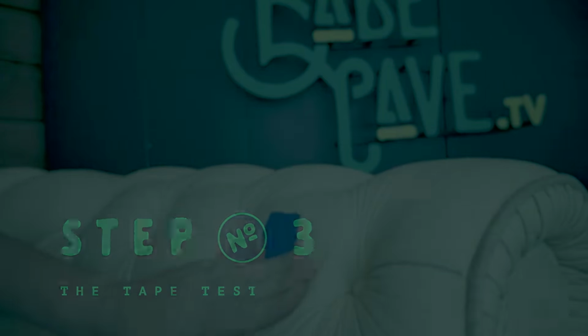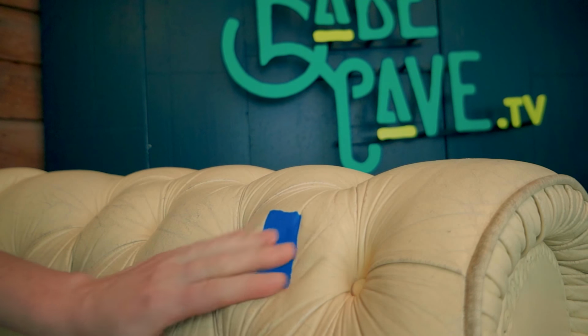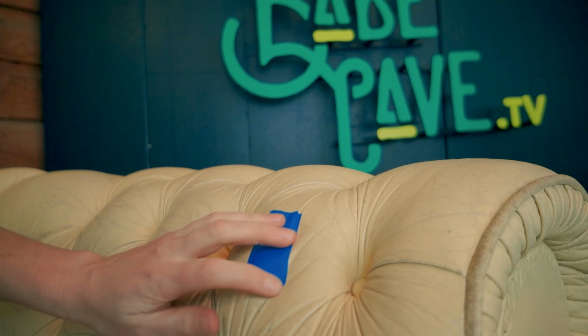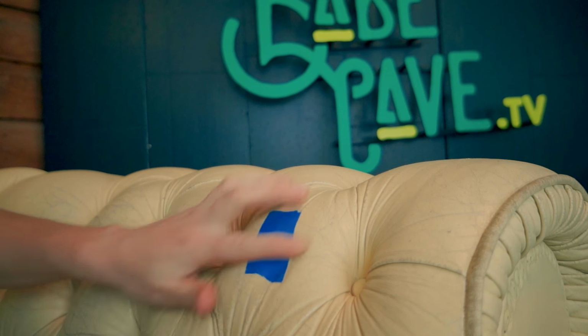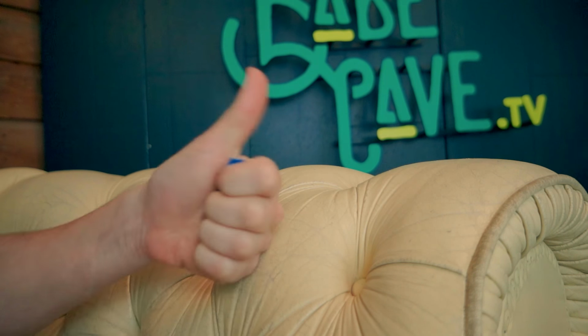Step 3 is the tape test. This is an easy way to see if your sofa is ready for dye. If you put a piece of masking tape on the surface, it should stick really well. If the tape curls up on its own at the edges, then you need to get more aggressive with your cleaning. But if you need your fingernail to peel up the edges, then you're good to go.